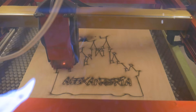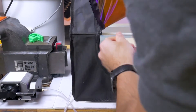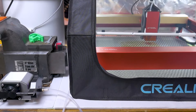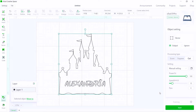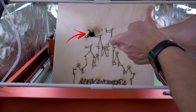The second type of hazard is fire. There are quite a few high-power lasers available on the market, and not surprisingly, they are capable of starting fires. In a video I recently made about the X-Tool D1 Pro 40-watt laser module, I accidentally started a small fire — it can happen with flammable materials if you do not process them properly. To avoid fire risk, we can eliminate flammable materials altogether if possible, but likely you're interested in cutting or engraving wood, which is obviously very flammable. To reduce chances of fire, use the correct material settings to avoid the laser dwelling in one spot for too long, as pumping a lot of energy into a small area very quickly will surely start a fire.